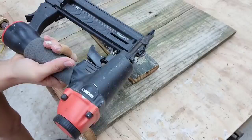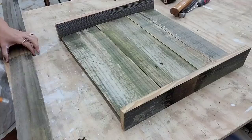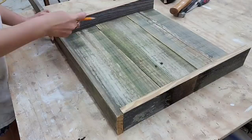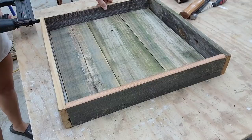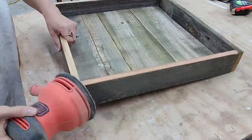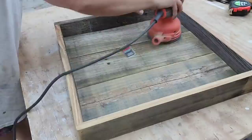I've cut two pieces 17 and a half inches long and I'm going to put them on two sides — the top and the bottom. I always attach two sides first, then measure and attach the other two sides. I find this is the quickest way to avoid measuring mistakes. Once it's on there, then you go measure it. I put my board up and draw a line with a pencil — I don't take out the tape measure. Then I attach the last two pieces with my nail gun. Once the piece is all together, I give it a nice sand down using my orbital sander to round out all the edges and make sure everything's smooth.